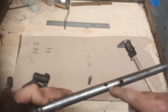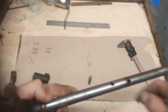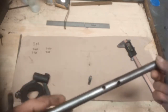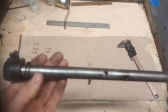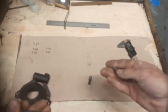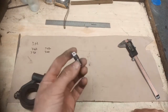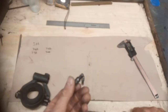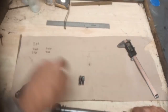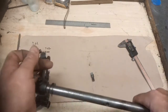But I went and had a look at one this morning and the new pins in the shaft they supply just wobbled around everywhere - it was an awful fit. So I was in no better position using that shaft. Back to the old shaft. I've picked up another tapered pin - this is the first pin I had, this is from David Manners. I can't actually measure the difference; they measure virtually the same, but they fit in the hole differently, and this will have to fit.